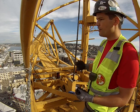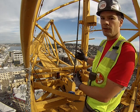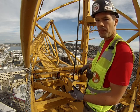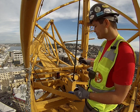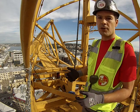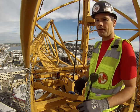One thing you can do is put tape on the rope wherever the problem is, and then in the morning you can inspect it yourself without needing a different person up there. Sometimes people use paint pens to mark it — that paint will stay in there for quite a while. That way you can find that location again and give it a second look without needing a bellman or signal person to work through it with you. Those are the techniques I use — I hope that helps you out quite a bit. Thanks.